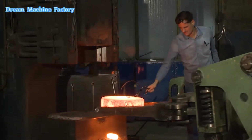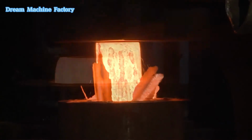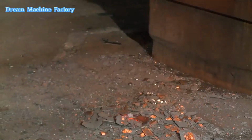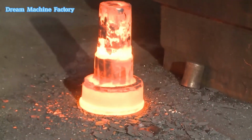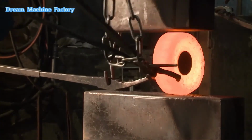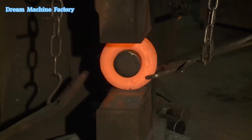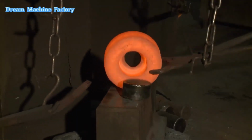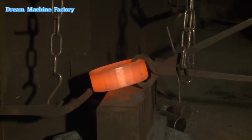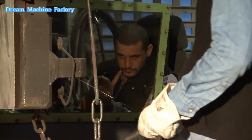In modern-day forging, raw materials are heated to temperatures ranging between 1150 and 1250 degrees Celsius. Smaller pieces are then forged using steam hammers, which have impressive weights between 300 to 6,000 kilos. Larger workpieces are manipulated with hydraulic upsetting presses. The company produces a wide range of forged products, ranging from 10 kilograms to 2,500 kilograms per piece.